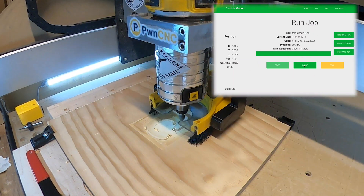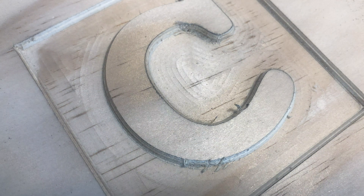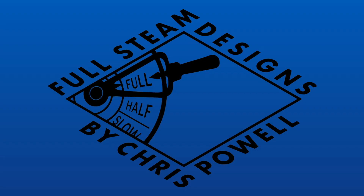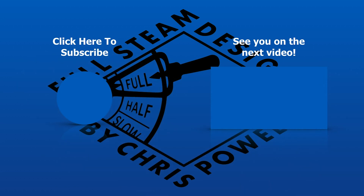These are some pretty low-quality bits, that's why they were still in the packages, so you'll notice we certainly aren't getting a nice clean cut. But what I want you to notice is the transition between where the V-bit and end mill were cutting — we have a nice sharp corner and there's no difference in height. That's really the important thing when doing any combination cut with a V-bit and end mill: you want to make sure you can't see where those two bits transition between one another. Thank you for checking the video out. Please go check out PwnCNC — link in the description. They're not a sponsor, I just really like what they're doing for the CNC and maker community. They also make great dust boots and clamps. See you guys next time.